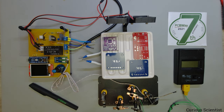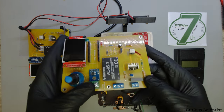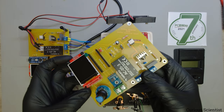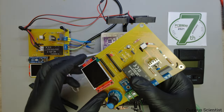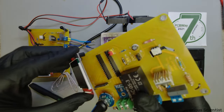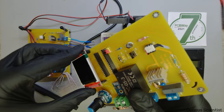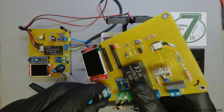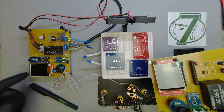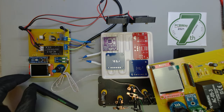This is the second build - I have the first build here in my hand, which is what I built in the second video. In that PCB I still had the sockets for the display and also a socket for the rotary encoder, but for this one I got rid of those and directly soldered everything to the board.